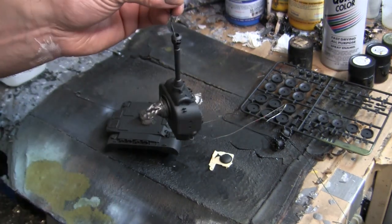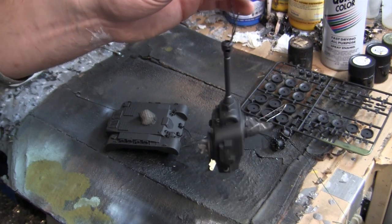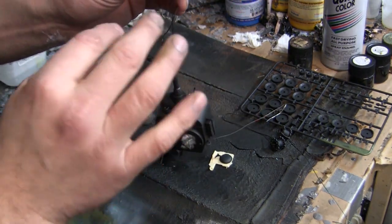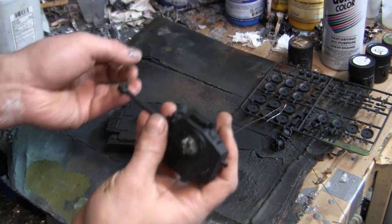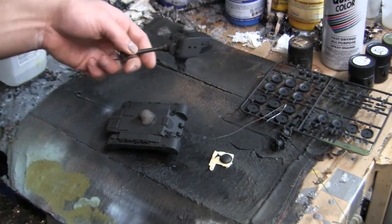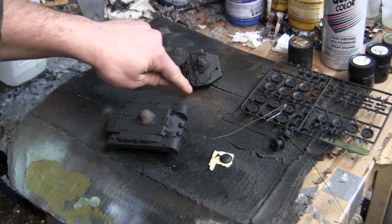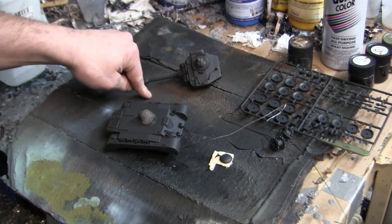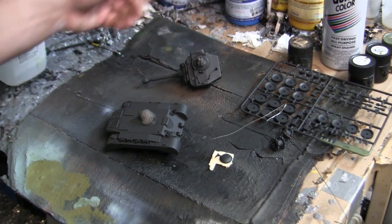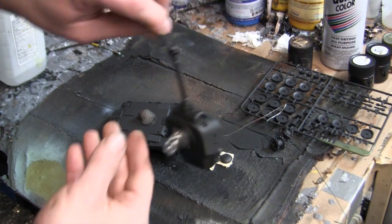Once you paint the component, you can just simply hang it up on a clothesline or a rack of some sort, and this will have zero contact with anything that's wet. If you're painting parts, a lot of times you might paint it, then set it down. Well, guess what? Now the location where you applied the paint is making contact with the floor of one sort, and it can add some complications. By suspending it, this reduces that immensely.